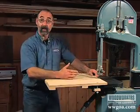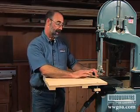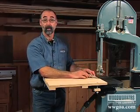If your front to back adjustment is just a little bit off, then the circle's not going to cut perfectly. So sometimes you're going to need to do a test cut, tweak this position just a little bit, and then correct it before you go on to the real circle.